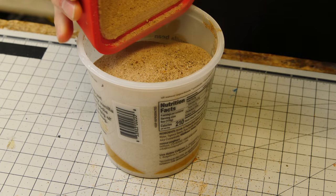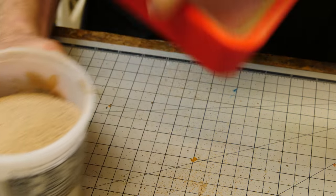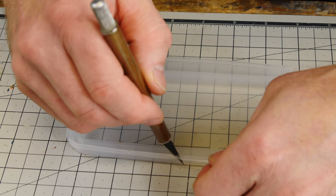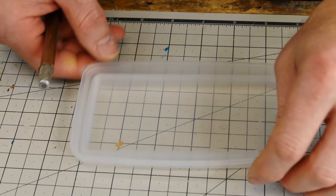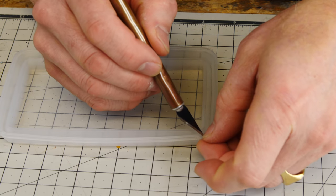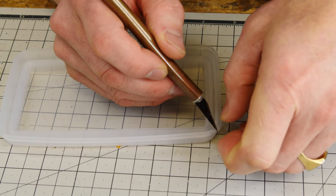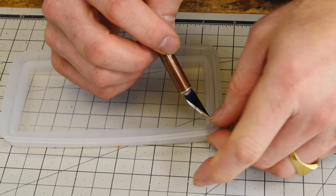In the morning I take the sand out and wash out the part with some water, then trim off any flash — it's pretty minimal flash here, and you can almost tear that off. No big deal to remove.